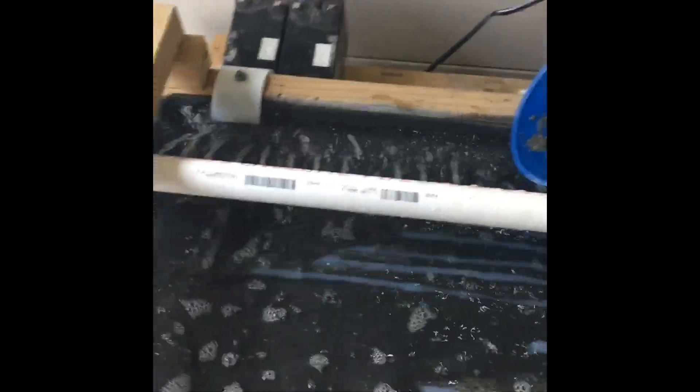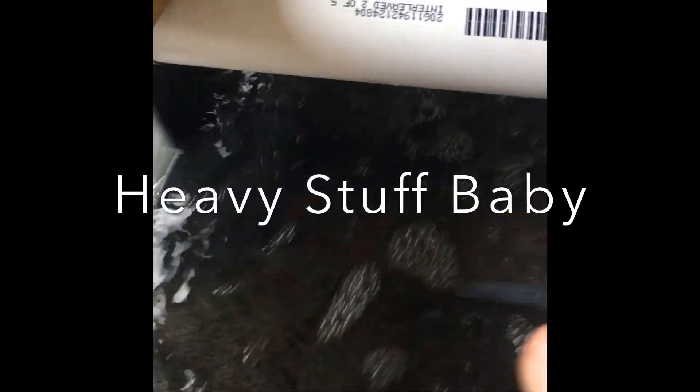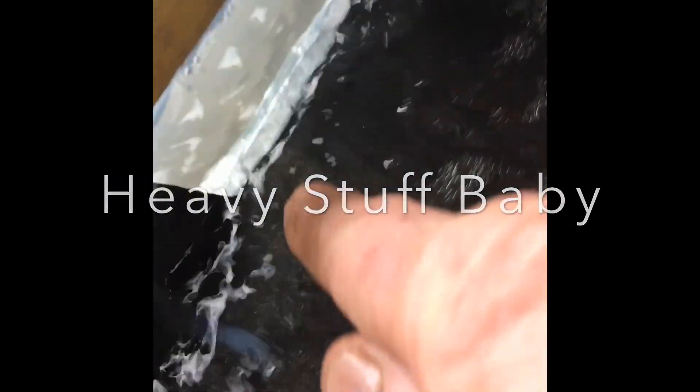There's quite a bit of heavy material in here still, and this is exactly why I need more surface area. I tried to cheat it by going this way and got these guides in here to push the water back — you can see that by watching the bubbles — so it forces a little more surface area instead of just going straight down at an angle. Same old issue though: I run the material three or four times and the gold comes out eventually, but it takes a while. The fine heavy stuff is trickling in here.